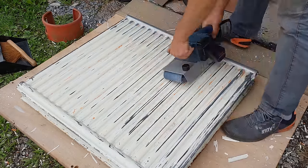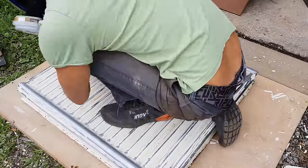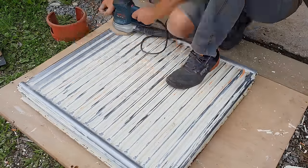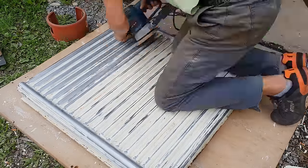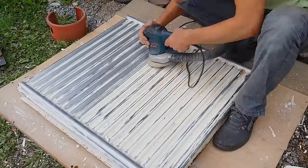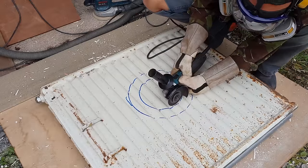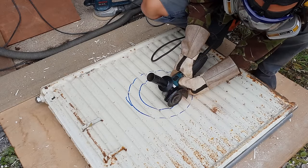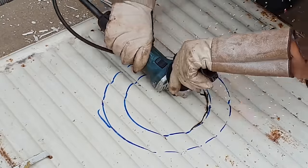When I was scrounging around and thinking about what scrap metal I could use to make this hot plate, I did the calculation to find out the gap that would have to be between the top and the bottom of the hot plate, given the diameter of the flue pipe that we have on the rocket stove. Turns out that the gap between the leaves of your standard double radiator is about bang on.